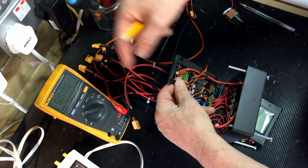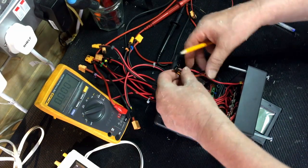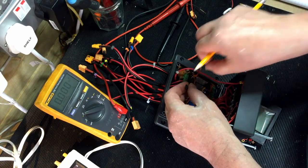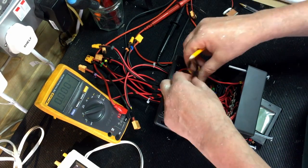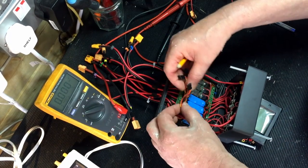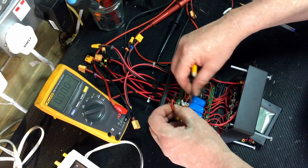So these were really quite long originally. I've just done this because I want to keep them in there. If I'd had more space, I'd have wired these onto a little header pin so you can plug it in, but I just don't have the space inside. So I've kept these on tails. These 4 don't come with a second output. They've just got the one output.